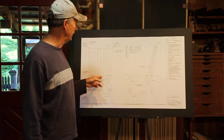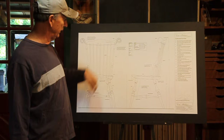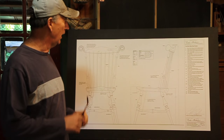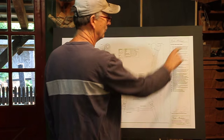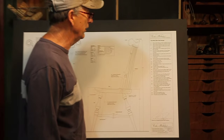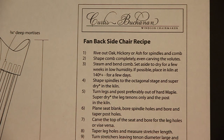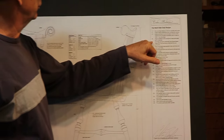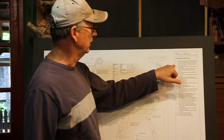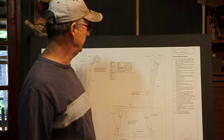Here are the elevations, and I'm going to do the double bobbin version although the elevations show the baluster turnings. We're going to go after the comb first, because if you go over here to my recipe, it says right out ash, hickory or oak — actually it says oak, hickory or ash — for spindles and the comb, very first thing. So I'll shape the comb, then I'll steam bend the comb, and then I'll shape the spindles and put them in the kiln.